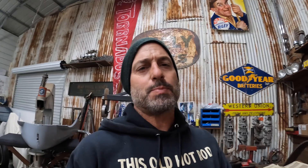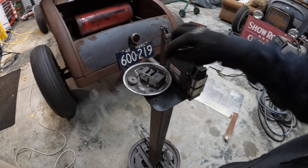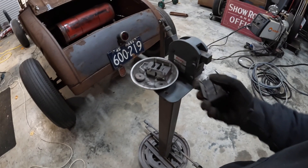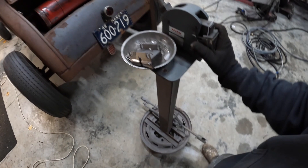I've been working on this rear crossmember cover for a little while now. This is where I'm at — I got a pretty good arch to it. For the most part it's pretty even, kind of hard to tell, but I held it up and it's close enough. I need to switch out my shrinking jaws and put in my stretching jaws. Then I'm going to get this crossmember cut down to length — I need 40 inches — and we'll see how it fits.